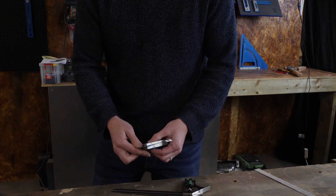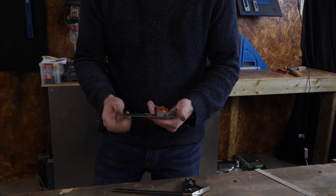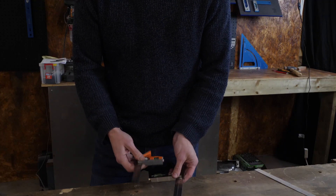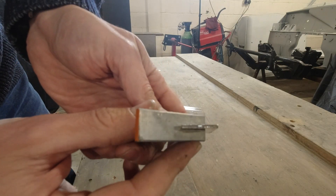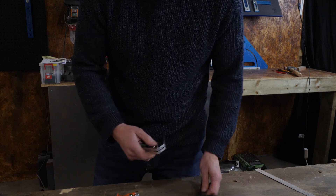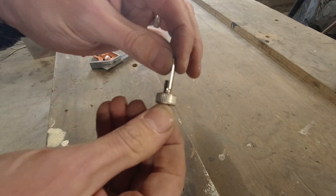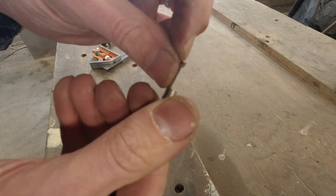Here's one of Matt's — a small one he uses quite a lot. You can tell it's a lot better; this is by Bahco I think, and it's made better — the stock is thicker, it seems like a better made tool, but it wasn't very expensive. Still, it follows the same design: they all have this little groove inside the ruler, and there's a hook. If I remove this one, you can see how thin the hook is — over time that can become work-hardened or lose its groove. That's the thing that breaks apparently.